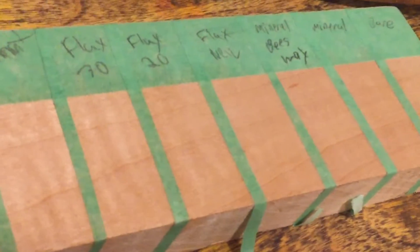As you can see, that's what it looks like from the new bottle — this has been set for about a month and it's still liquid. The sand-washed, the 20-day, and the 30-day are all kind of jelly. The 30-day actually has a bit more viscosity than the 20-day, but I think 20 days is all you would really need. That's mineral oil just to show what clear looks like. These are a bit more yellow than I had hoped. That's a piece of maple with the various finishes — I can't really see any color difference. Lighting is bad here but there's really no color difference between the different oils when it's on the maple.